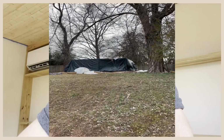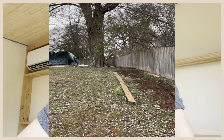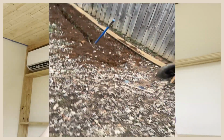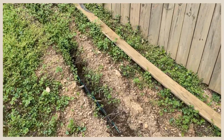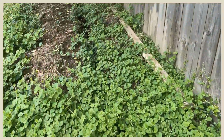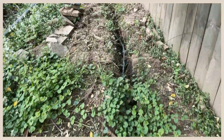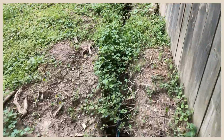Okay, after the flooding happened and that dried out a little bit, I moved into the yard and I started trenching for the wire to run up to the building. This was just an absolute disaster. I'm gonna call it that because it was mostly just stupidity. I dug the whole thing by hand. It's a 140-foot trench that's 18 inches deep. We've got some pretty firm ground here. Also, we have a lot of roots, like big trees that I had to go right next to. So it was just a major headache.